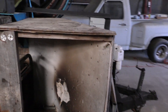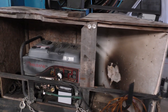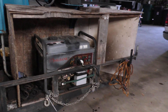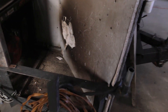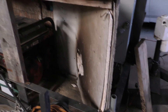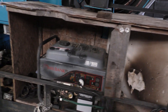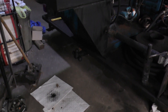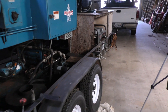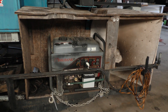You can see what the previous owner did — he used plywood and some sheet rock and it helped out significantly. I've got some tin and some lumber and I'm thinking maybe I can insulate the inside. I might even put an automotive muffler coupled on right there and run the exhaust out the front corner of this trailer, and it'd basically be double muffled. Hopefully that would drop the decibels down, because when you're back here running the rig with a helper, discussing a procedure or some readouts, you can't even hear yourself think with that generator going.